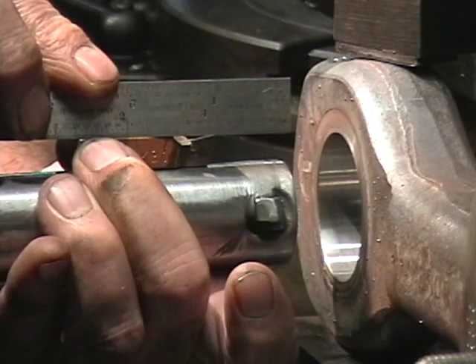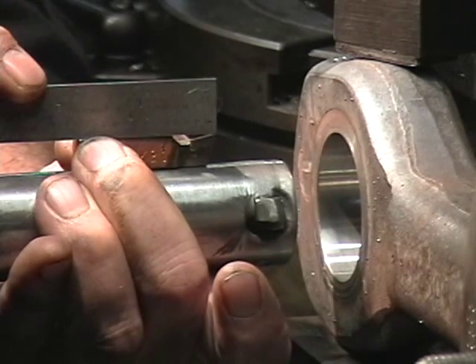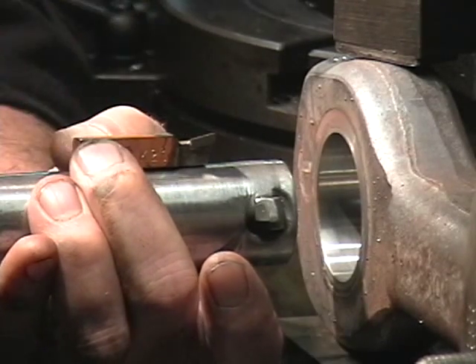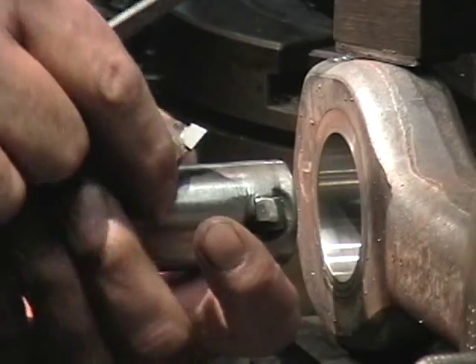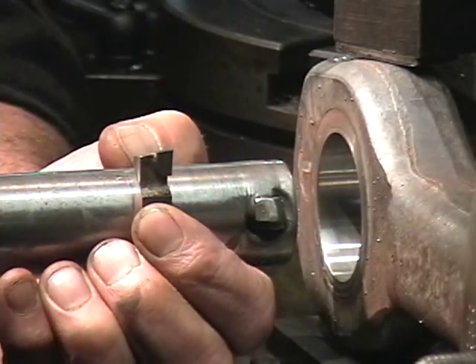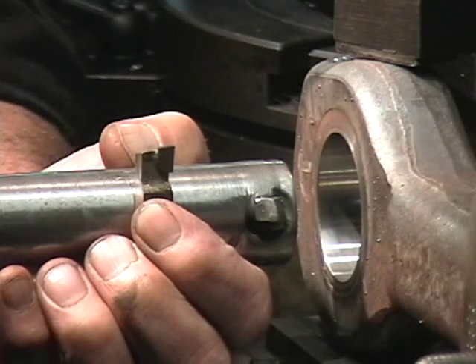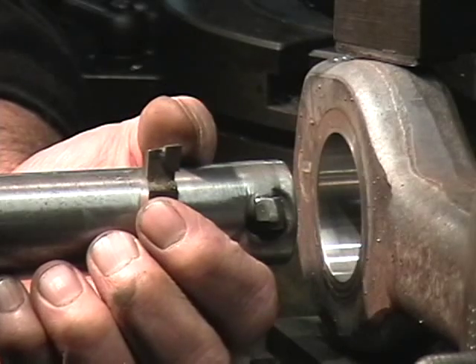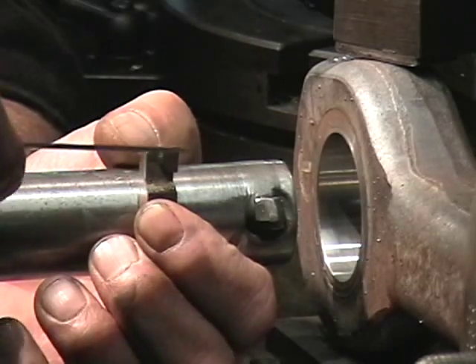The TSA tool also has a lot of top rake. I hope you can see underneath that scale, but there's quite a beak on that tool. It has a little more side rake than the TSC. It's meant to work like this and go to a straight shoulder, and it will allow a little more aggressive feed rates. You can adjust that as you grind it, but these will chatter easier.